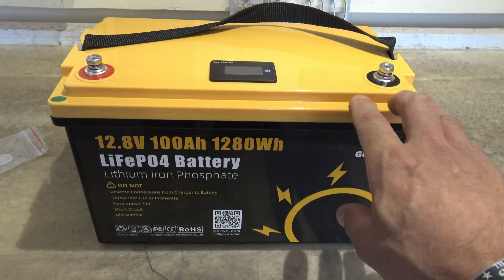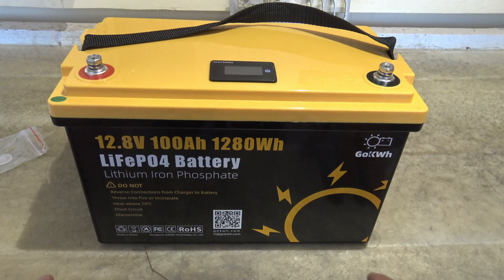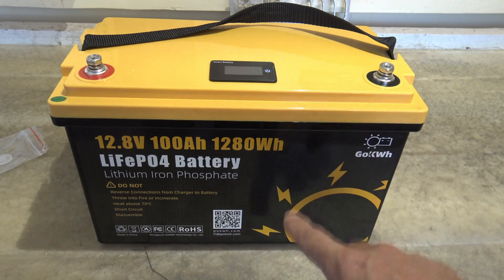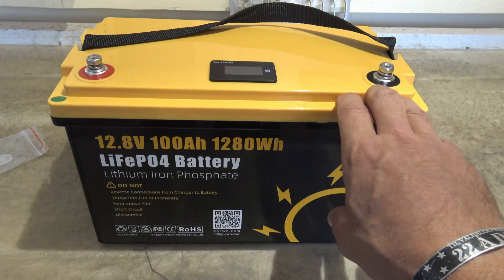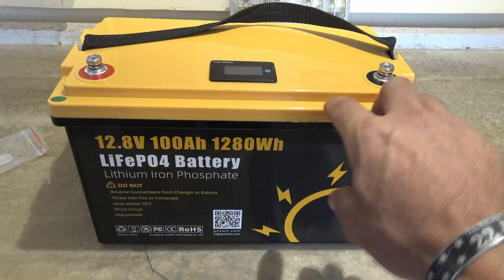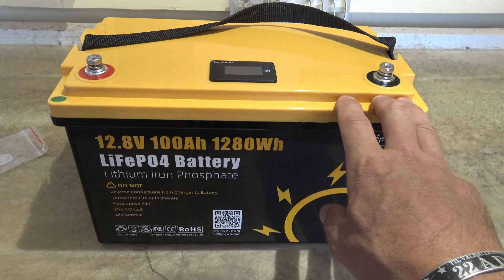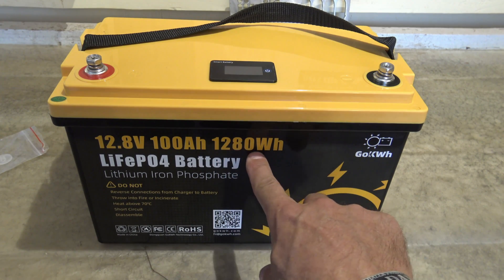This battery is made up of grade A blade pouch cells and is rated IPX5. You can wire it in 4S or 4P. In 4S — four batteries wired in series — you would get 51.2 volts at 100 amp hour capacity, giving you 5.12 kilowatt hours. In 4P — parallel — you keep the voltage at 12.8 but increase your amp hour rating up to 400 amp hours, and the kilowatt hours remain the same at 5.12.